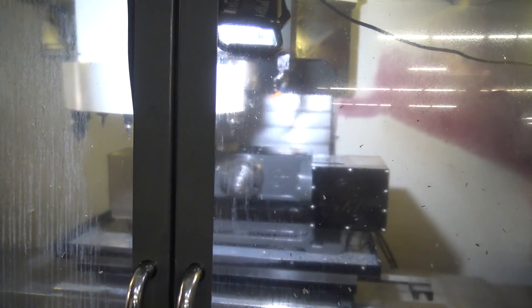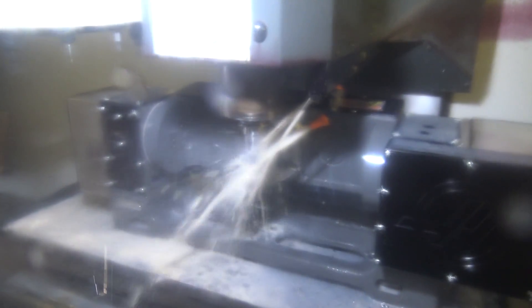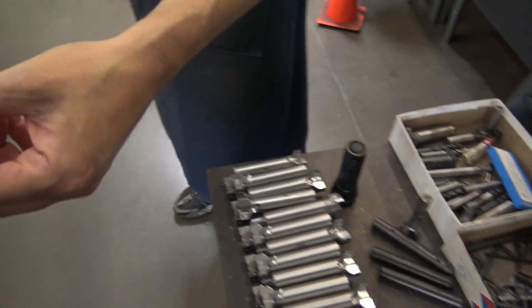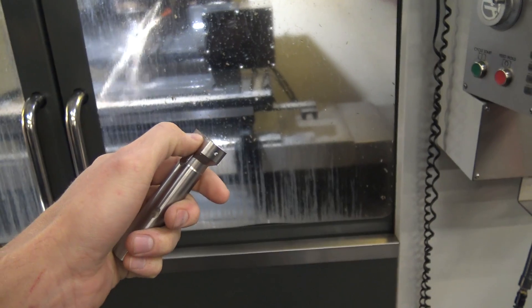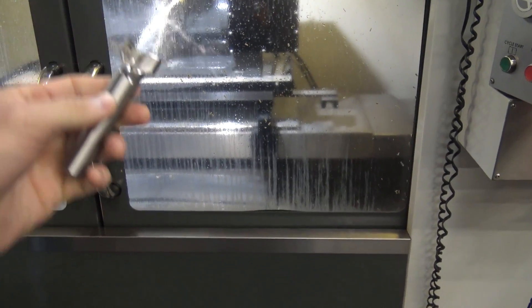So there's a five-axis Haas — a VF3 three-axis that's got a five-axis trunnion on it. These are the parts we're making right here: Shear Hog, one and a quarter inch, two flutes. Right now it's finishing the pockets — machining the inset where the insert will actually go. The thread hasn't been thread milled yet, but that'll happen here too.